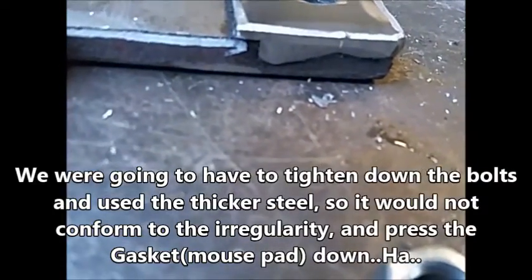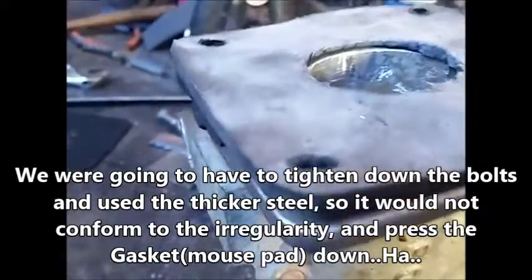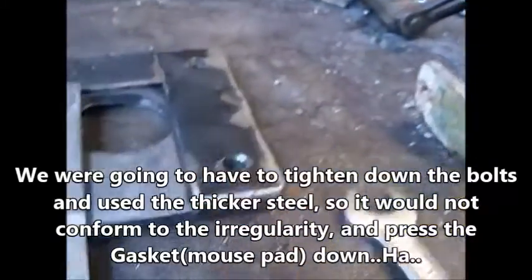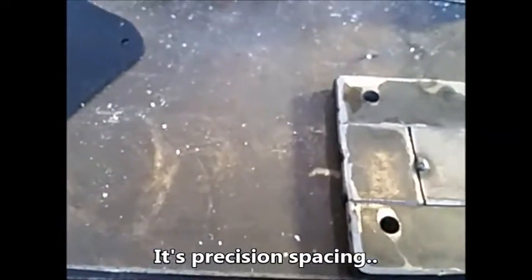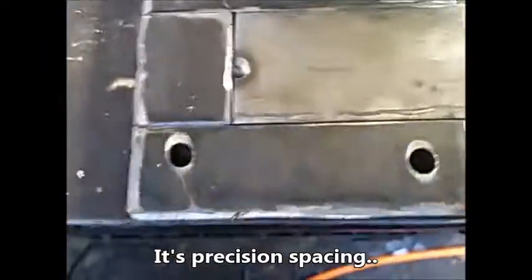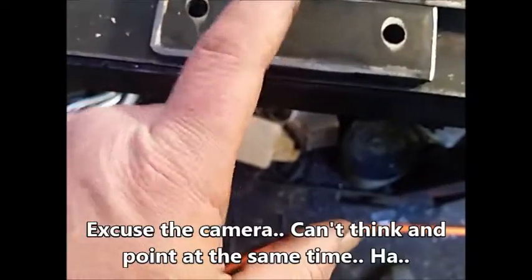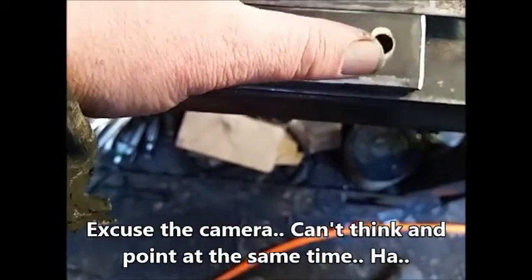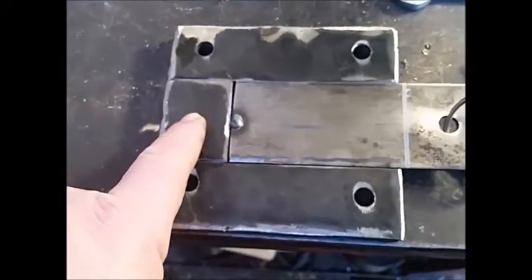This is how you make your gates. This is ridiculously thick here — the bottom, you can see that's 3/16 inch thick steel. But we want to be able to tighten it down, clamp that gasket real well, shut off the air leaks, and not deform the metal because this gate is going to be really finicky. It needs to move smoothly and it's metal against metal. So there it is — this is a five inch plate with an inch and a half on each side, which is three inches, so inch and a half here.